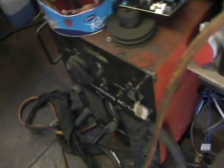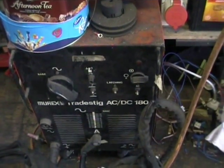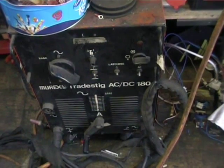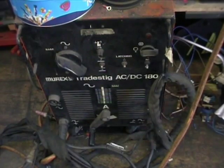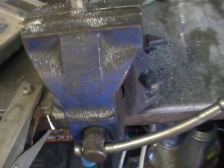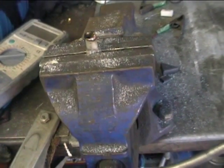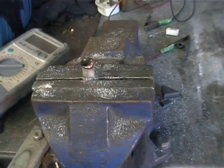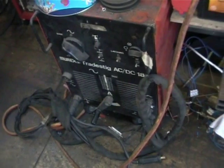One of the things we have to understand is that this machine puts out about 55 volts, perhaps 57 in a pinch. A modern EV can be 150 volts plus, and under a failure circumstance you can be talking 500 to 700 amps. So what we are doing here is breaking about 55 volts at about 160 to 180 amps, and even so we are going to get some pretty spectacular arcs and sparks.